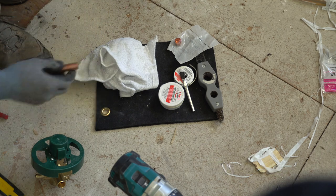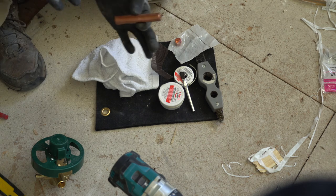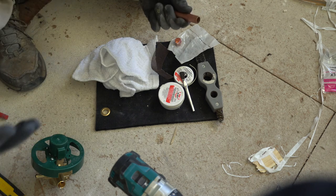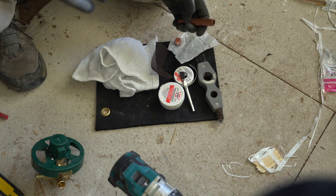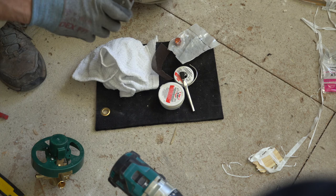The first thing you're going to want to do is get this copper really nice and clean. I'll do one side so you can see the difference between clean copper and dirty copper. If you try to sweat something on with dirty copper it's going to be a really bad connection and it's probably going to fail on you. So I'm going to use this half-inch diameter here.